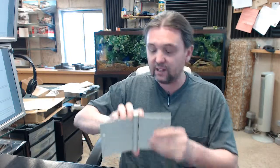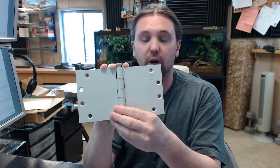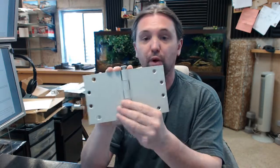You don't see it often, but I've seen it in construction of buildings that go back to the 19th and very early 20th century. The original Capitol building of the state of Iowa is full of doors that are set deep into like 16-inch thick walls, and they have these gigantic wide throw hinges because you've got a 16-inch thick wall, a frame, and then those doors are set in the center of it. That would be an example, albeit an exaggerated example, of where you would also use a wide throw hinge. So why the client is using an 8-inch on this order, it's just because the math works out based on that calculation that 8 inches is the proper size that you would need for this.